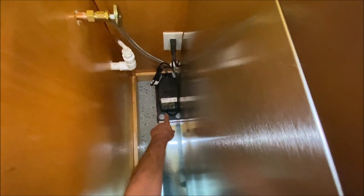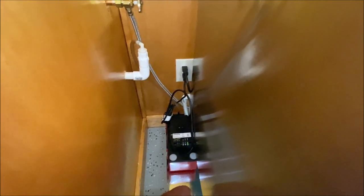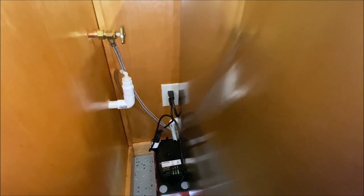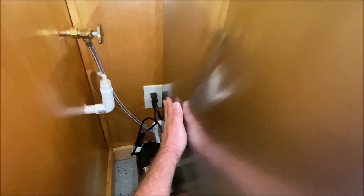The two spades right here, that can be used to break something. I don't know, I haven't paid attention if this tolerates 120 volt or just low voltage. I know the float switches that we put in the pans for our HVAC systems claim they tolerate high voltage, but I just don't know how much, like a compressor running or what. So I'm going to let you guys make some suggestions to me. There's two or three things to protect here.